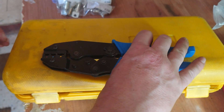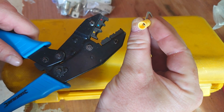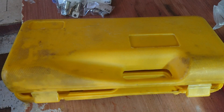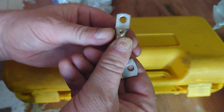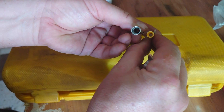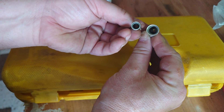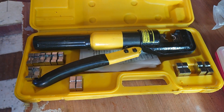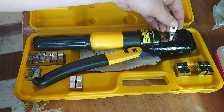We're all pretty familiar with standard crimping tools for automotive crimps, but that's not really man enough for the sort of cables we're doing here. This is a 25mm cable — compare it next to that yellow automotive crimp and you can see the size difference. We've also got some 50mm cables to do, which is even bigger. So we need something a little bit stronger, and this hydraulic crimping tool is just the ticket for these size of crimps.